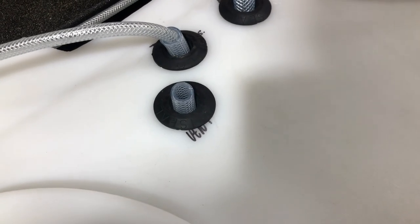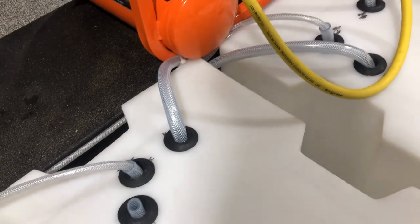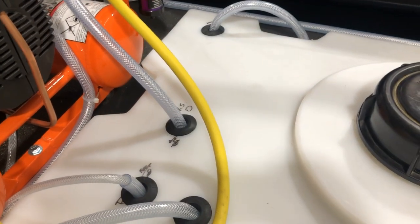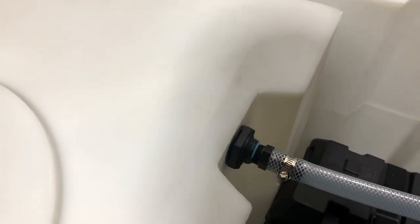When I was using the Hudson float valve the water would come up out of that vent because these tanks are sealed — the lids don't breathe, so you have to make sure the tanks can breathe. Always vent your bleach tank down through the bottom of your trailer or truck so the off-gassing goes through that hose and doesn't attack and rust out your truck. We also use uniseals for the pressure washer bypass line. The only time we still use a bulkhead fitting is for the water supply inlet into the tank and the water supply outlet at the bottom for the pressure washer.